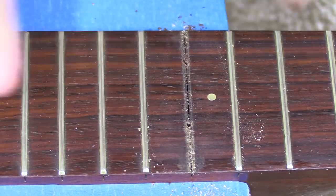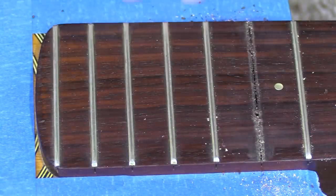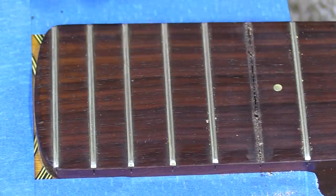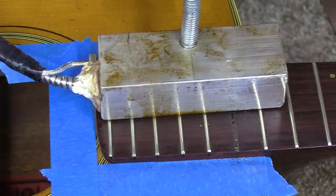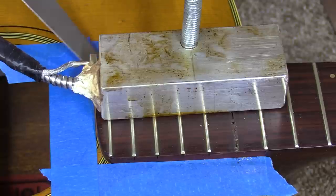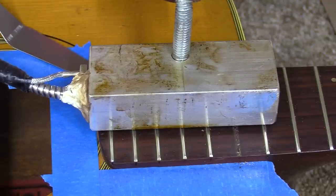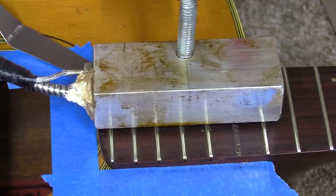Now the next thing I'm going to do — I did that while everything was stiff so drilling those holes would be easy. The next thing we're going to do is loosen this whole section that overlaps the body. For that I'll get out my heating tool and we'll start heating this up and I'll start working a knife underneath. I've got the heater on there and I've started on this side here. I'm just trying to get it warm. I've also got my little palette knife out here that I've been starting to work underneath. I'm really trying to soften that glue underneath the fretboard and it doesn't really want to come soft.